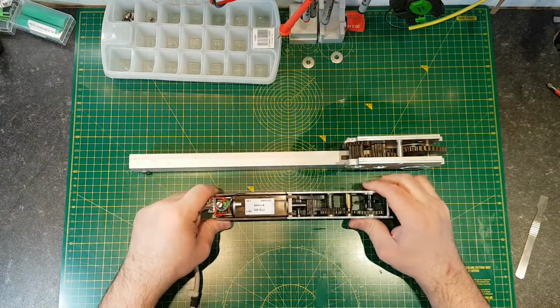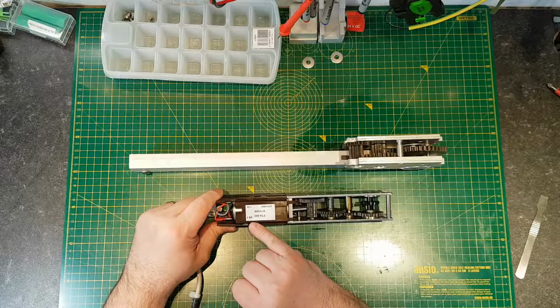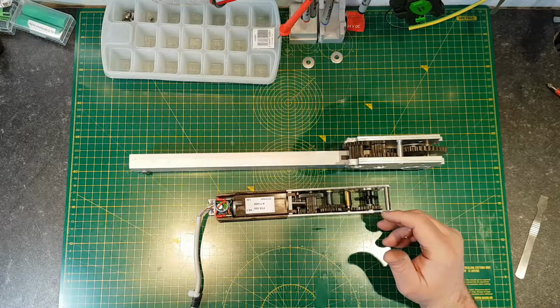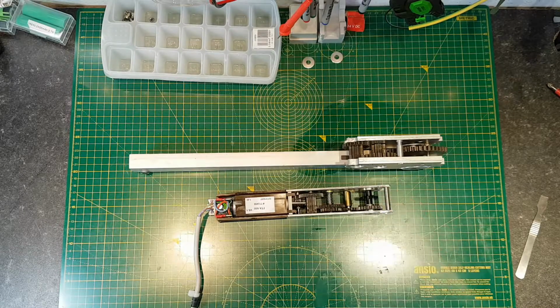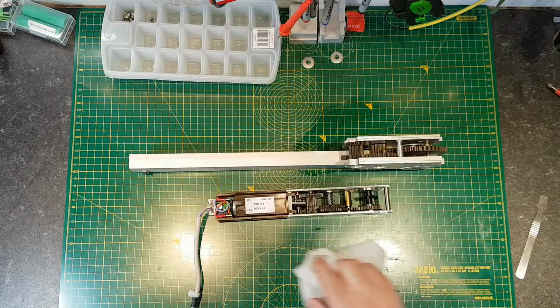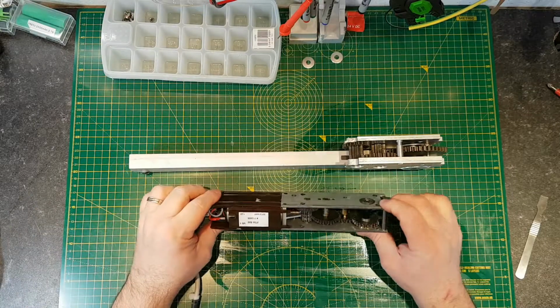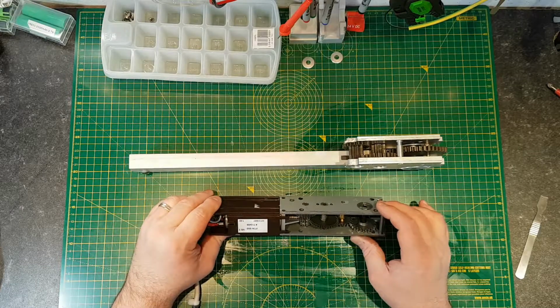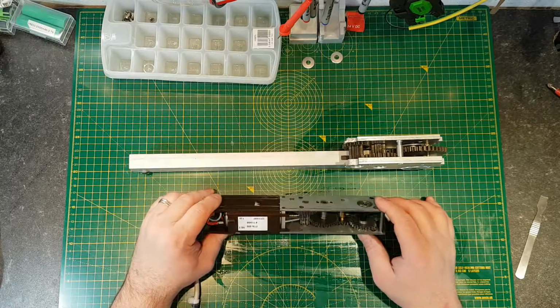That motor, it's a 24 volt, I think it's 1 amp motor, but this door arm applies 600 newtons of force, so it does that through the gearing, because there's no way you'd get anywhere near that sort of force directly from that motor. The motor spins pretty fast, and then effectively the gears reduce the speed and they create the torque. You can see that's why there's quite a number of them.